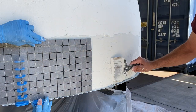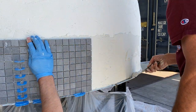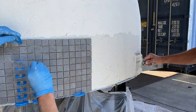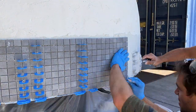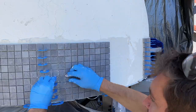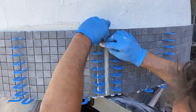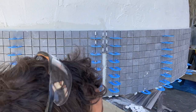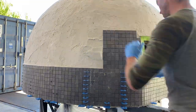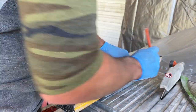As for the application process, I'm not using your normal thinset trowel — I'm actually just using that six-inch knife, because you're able to apply a very small, thin, even layer of thinset as you go across the surface. You really don't need a lot of thinset for tile like this. For this entire project, I'm only using two different types of shims: the large blue horseshoe shims and the small white wedge shims. Both shims act in very different ways, and I'll be getting into more detail as to why later on.